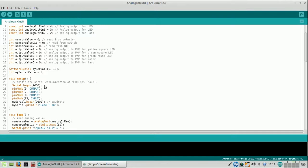So first of all, I need to do some adjustment in the code, and I will start here, and it is of course from my previous attempt for serial communication, which I've left for now. So I'll start here a new part of the code, and first of all I need to make the PWM buffer clear. Create a new eraser variable, and this is the decimal value for the binary 111.